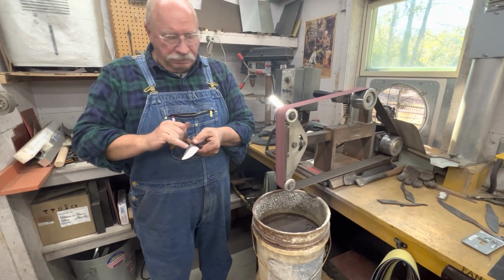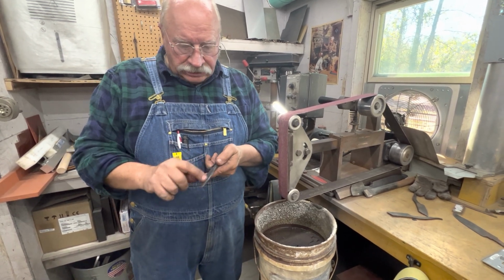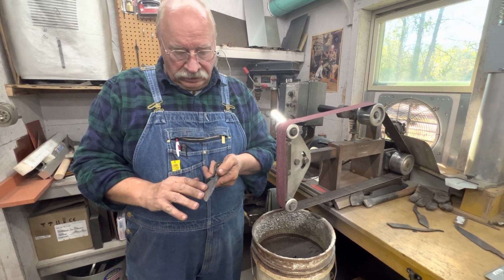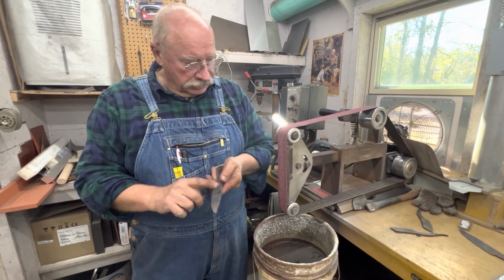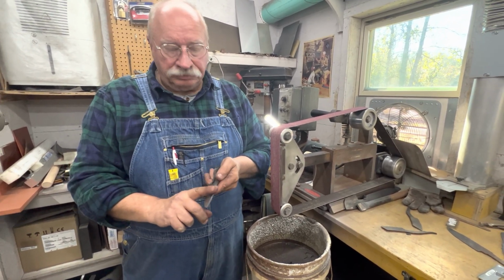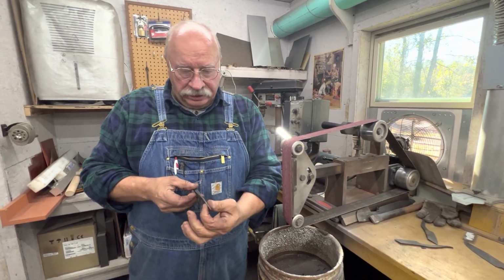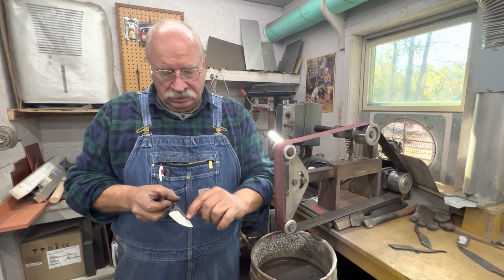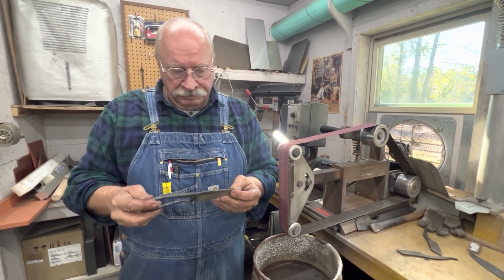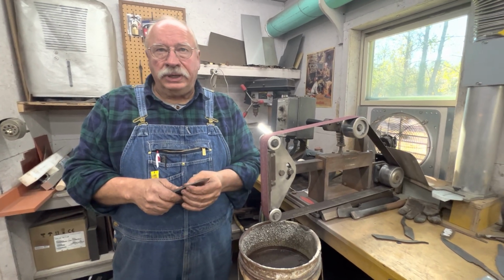So in other words, the back bevel works with this grind. It accommodates this grind and vice versa. So this straight line grinding, because the platen is straight, it misses it. Same way here. And that's because I put a back bevel to make it more predictable as far as this outcome right here. And that's all in the world it's for. It's just for looks. Now, there's going to be people who will tell you, well, a big knife, if you do that, it'll cut better, and it may do it.